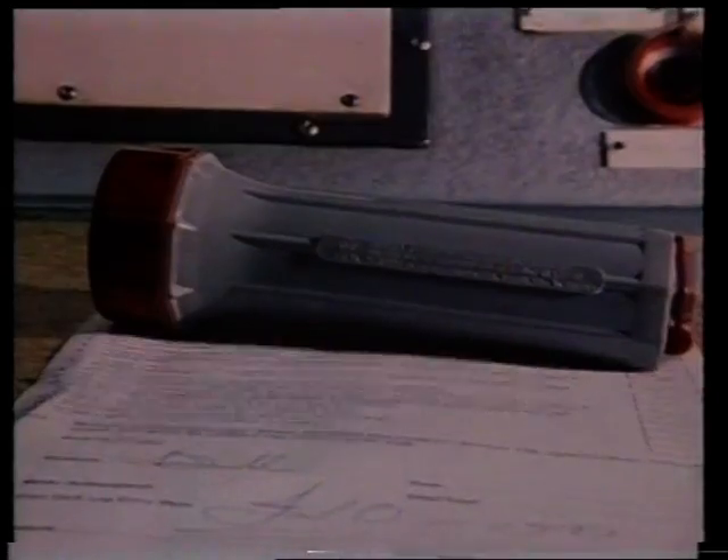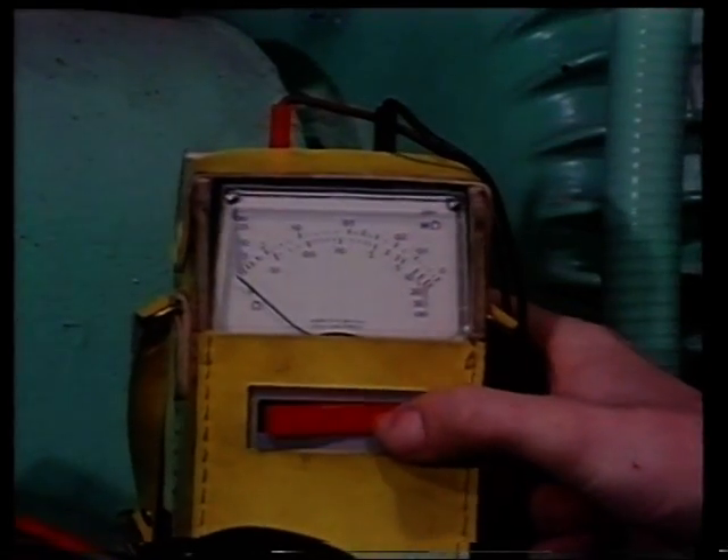Finally, check their labels to ensure that all portable apparatus such as portable radios, torches or insulation resistance testers are specially approved intrinsically safe types certified for use in hazardous areas. If you use portable electrical equipment or tools, ensure that their connections and cables are sound and safe to use in the area in which you intend to use them. This concludes the subject for Programme 6. We dealt with the special electrical safety design features built into a vessel designed to carry hazardous cargo, the essential difference between general electrical practice and specific electrical practice in hazardous areas, how to service a flame-proof light fitting, and how to prepare the cable and cable gland for a flame-proof motor. Emphasis was laid on maintaining the equipment's certified safety level at all times. This is the most important single difference between working on equipment for use in hazardous areas and other general electrical installations.